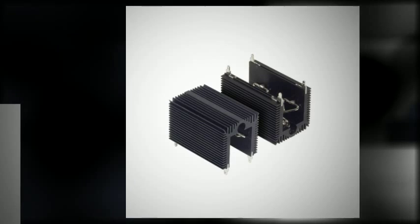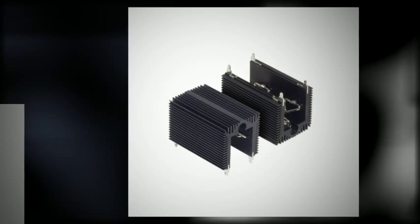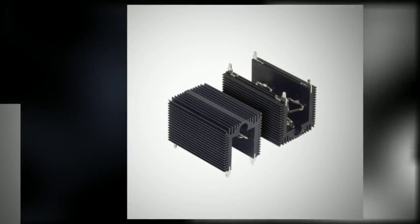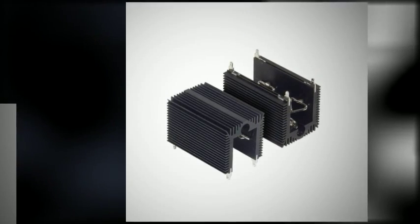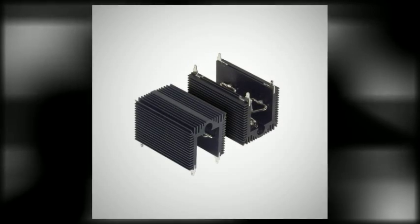Providing design flexibility is the M Series. This series can be scaled to meet the designer's power dissipation needs. The M Series is designed for TO264 and TO247 packages and can hold multiple devices. This aluminum heat sink provides the largest surface area, easiest assembly, and smallest footprint.